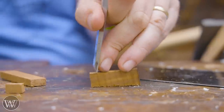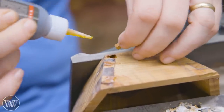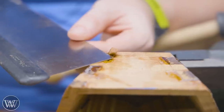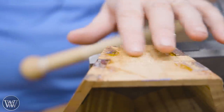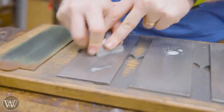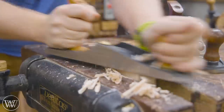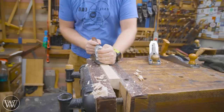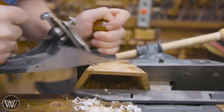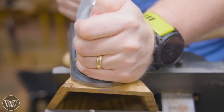I decided I did want to fill the bottom groove holes. I'm using some CA glue — I've just chopped these plugs off with a chisel at the appropriate angle, which were some really weird ones to fit into the shape. Put in a little bit of CA glue, hit it with some activator, and then trim them off. I'm doing this before the final planing so that when I plane it all, everything is nice and smooth. One of the nice things about plugging those is you can match the grain of the plug to the board. Now, torrefied curly maple is some of the most difficult stuff to get truly smooth — this plane iron has to be set up within an inch of its life. I ended up having to sharpen it a couple of times, but it's amazing what you can do with a perfectly set-up hand plane.